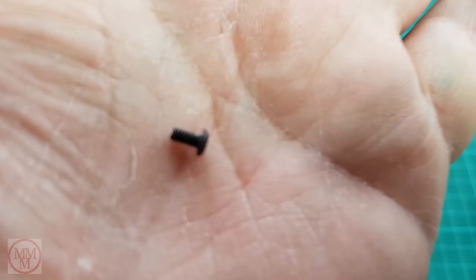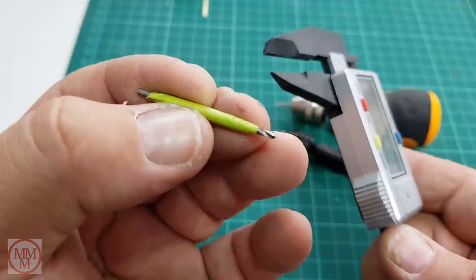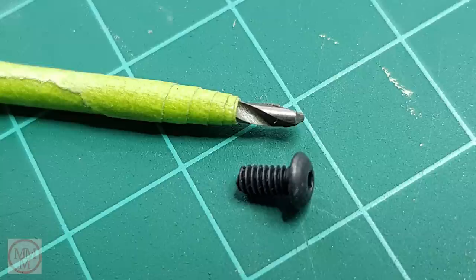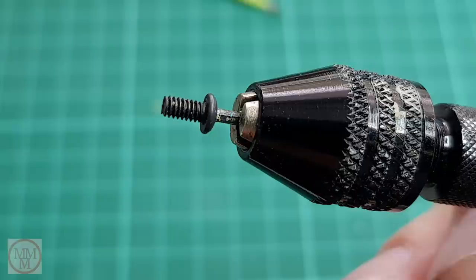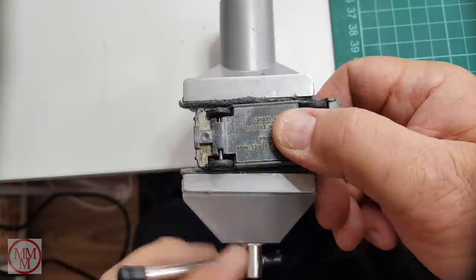Here's the type of screws I use when putting it back together — they are M2 screws, two millimetres in diameter. When I drill out the hole to tap and accept the screws during the rebuild, I use a 1.4 or sometimes a 1.5mm drill bit. I then screw them in using a hand chuck with a small allen key placed into the end of it. This is a close-up of the screw tap I use to cut the thread.